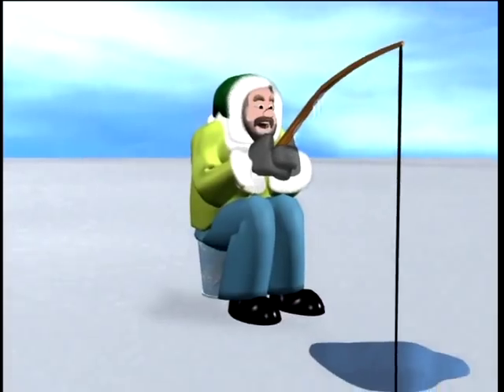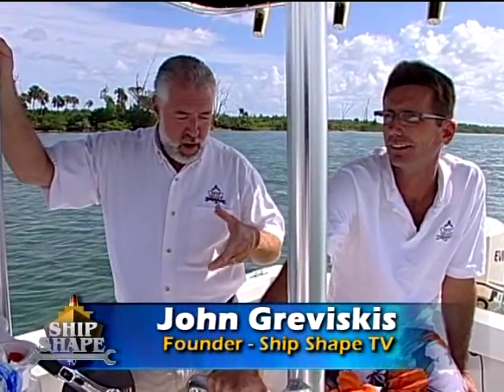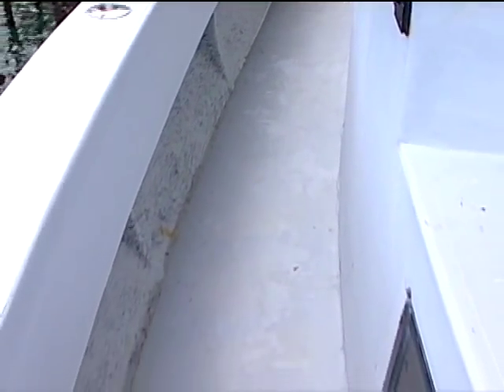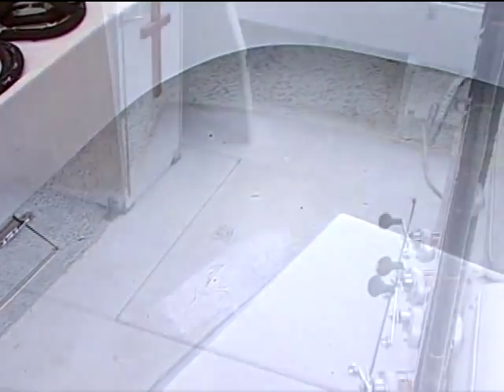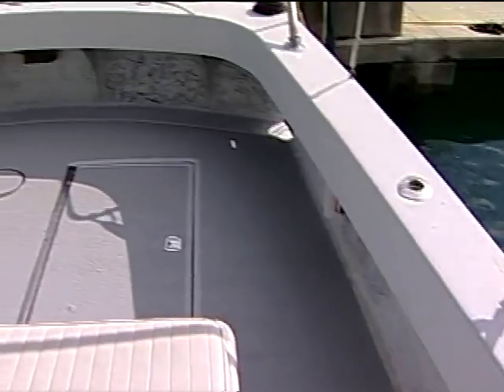Welcome back aboard. Fishing for boat improvement? Well, you caught it right here at Ship Shape TV. We are now in our 21-foot Seabird project boat, and I want you to take a look at the non-skid on this. This was painted with the silica thrown in, and we probably have four or five years of wear on this deck. You can see it is kind of popping through the paint, but it is wonderful non-skid. There are a few ways to non-skid a boat — this is one of them. But we showed you a product today called Tough Coat. I want you to take a look at the Good News fishing boat before we did anything — it was slick. The inner city kids, the military guys they take out, people coming back from war — they take a lot of people out into the ocean for free to turn them on to our world, which is so awesome. And here's the result of putting the Tough Coat — the after. These guys are going to have traction and confidence when they're walking around.